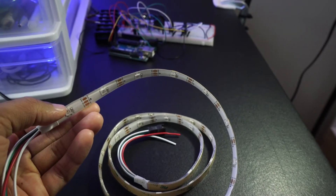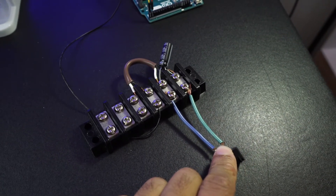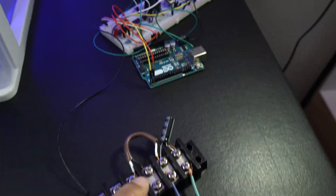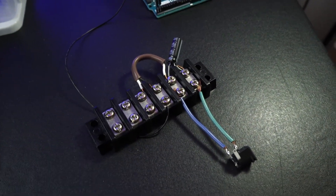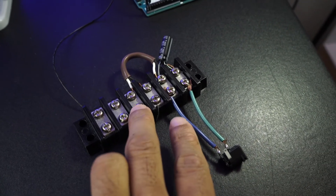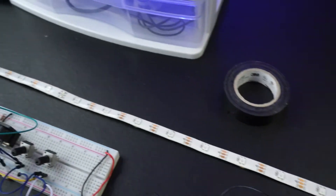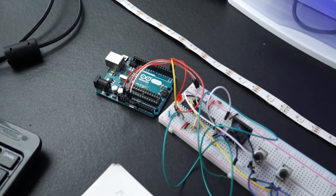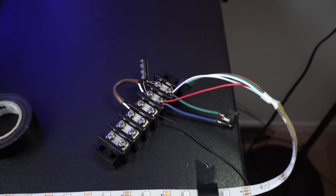I want to try this new strip and see how it looks. I've also added a hub — power comes in from the AC adapter, and I've added a large capacitor to handle the ripple that LEDs are known to have. The Arduino connects to the hub via ground, but the Arduino itself is powered from USB. The LED strip power goes through the hub as well, and the data line comes from the Arduino. I've used electrical tape to attach the LED strip to my table for now — maybe in the future I can do something more permanent.